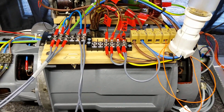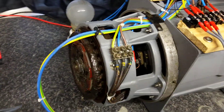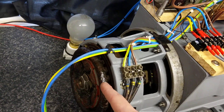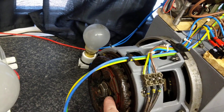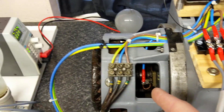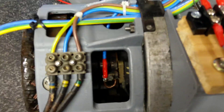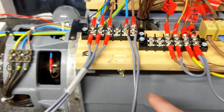The total output capacity is 3.25 kVA continuous. The three-phase is generated from the stator and then taken off here. The rotating magnetic field is generated from this, fed by two slip rings which are down in there.